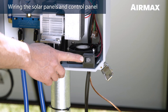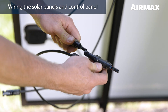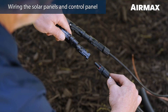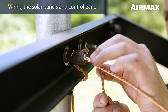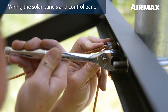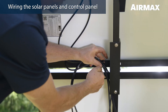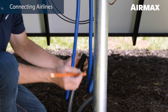Make sure the internal shutoff switch is in the off position. Attach the T-branch connectors to the positive and negative MC4 cables on each solar panel junction box, then attach the T-branch connectors to the corresponding leads on the control panel. Finally, route the grounding wire up the half inch ground rod clamp that is secured to the upper U-bolt of the easy mount main assembly. Loosen the bolt and feed the end of the control panel grounding wire into the clamp and re-secure. We recommend using the zip ties provided to secure the MC4 cables, and measuring and cutting cabinet flex tubes as needed.